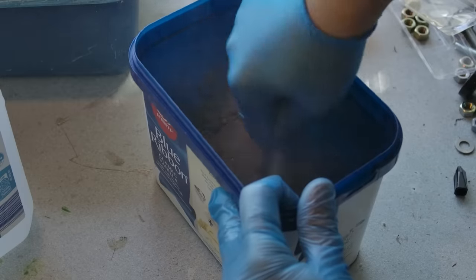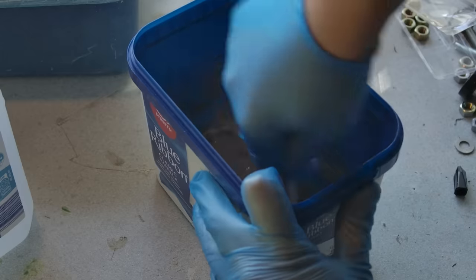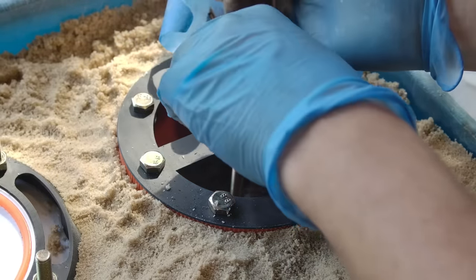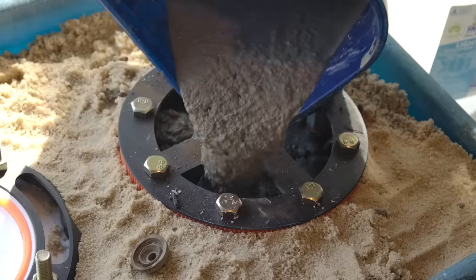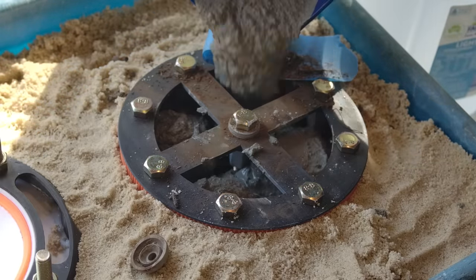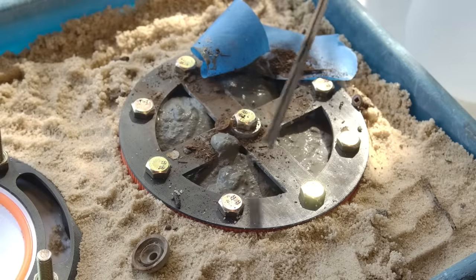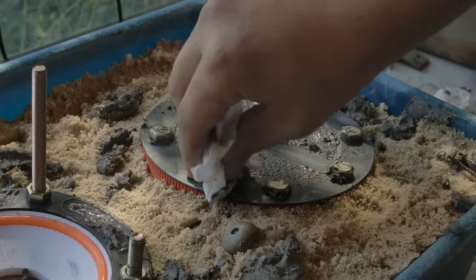I'm aiming for the wettest mixture that I feel comfortable with pouring. A mixture too wet won't set properly. I start with a small amount in the bottom before the first handful of metal. I continue this pattern until the bottom of the inner bolts, where I make sure to cover them with the cement. I then put in one more layer of metal, before finishing with cement for a clean look. I use sticks to ensure the mix flows deep, leave a bit of overflow, which I scrape off as it partially dries.